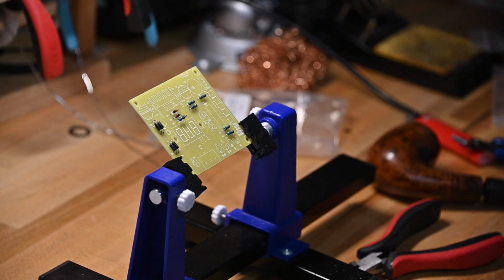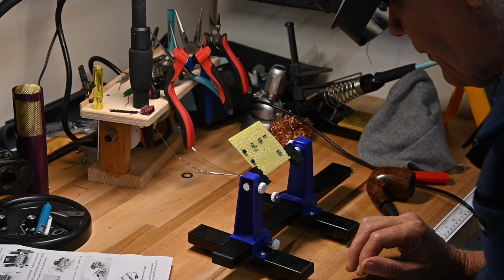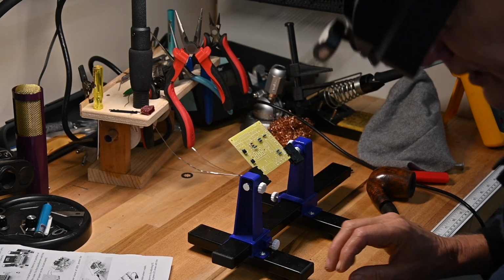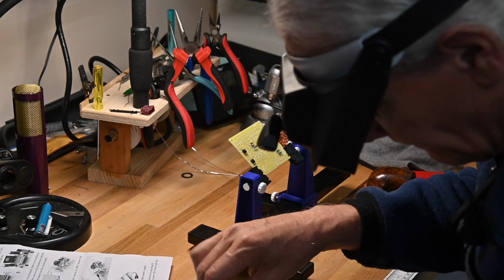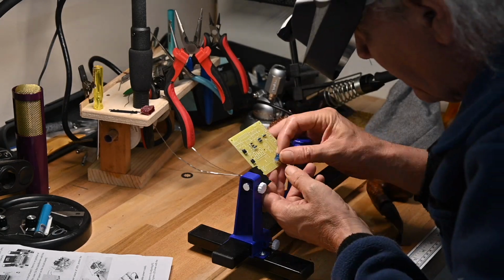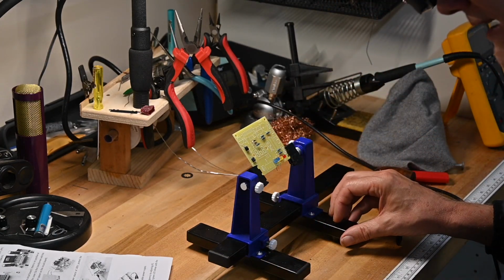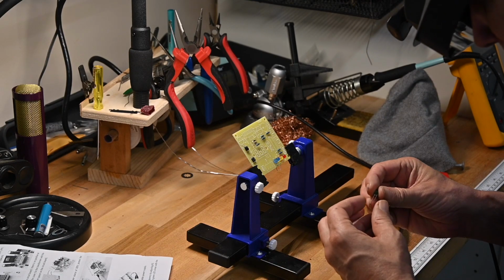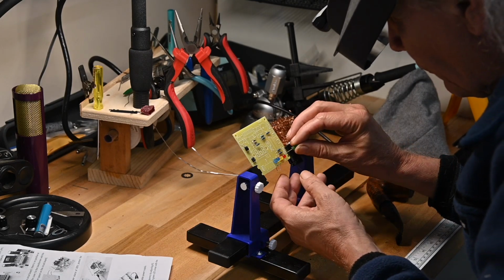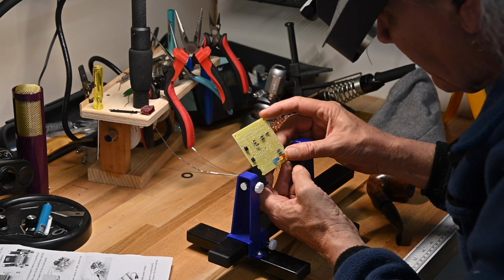board. I think what I'd like to do next are the four diodes on the bottom, the LEDs, since we're in a diode mood. Of course, all the while making sure we have our polarity right, long leg positive, green. I'm gonna go ahead and solder all these